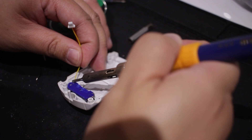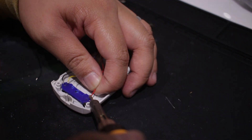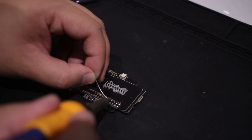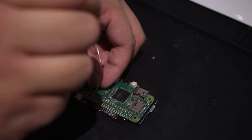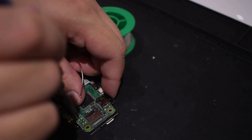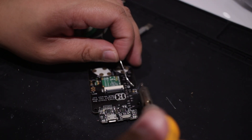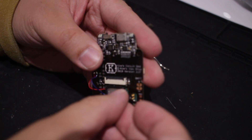Now for some soldering. The Circuit Gem came with some cables that will be soldered to the buttons and attached to the board. To prep the board for the Raspberry Pi, I added some flux so the solder can flow through easier. I added a small amount of solder to each pad so the Raspberry Pi can adhere to the board easily. Poking the holes with the solder iron and holding it for a few seconds was a little tricky, but constantly checking the continuity will help you know whether you've connected the board correctly. Once done, flip the board over and solder the two points for the speaker.